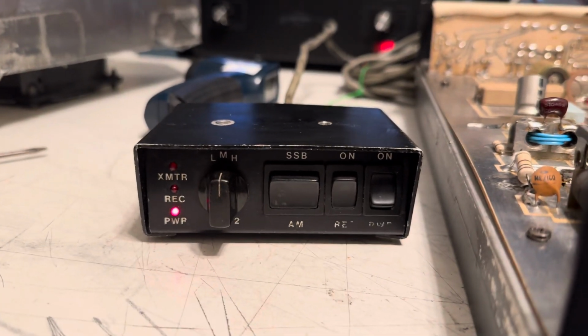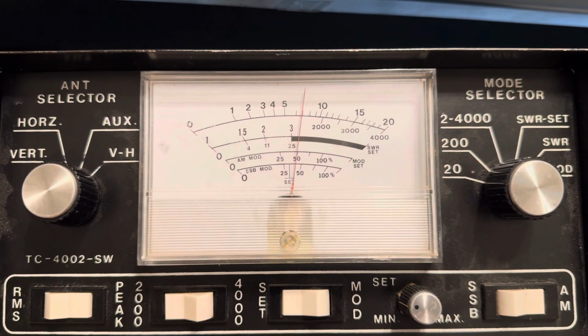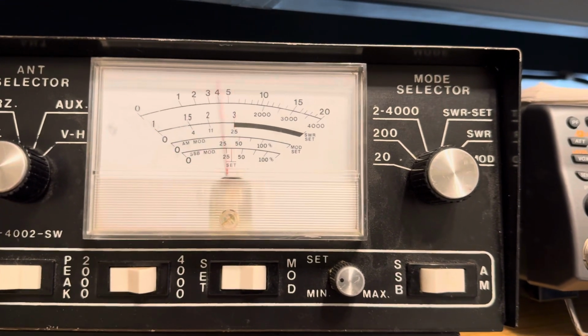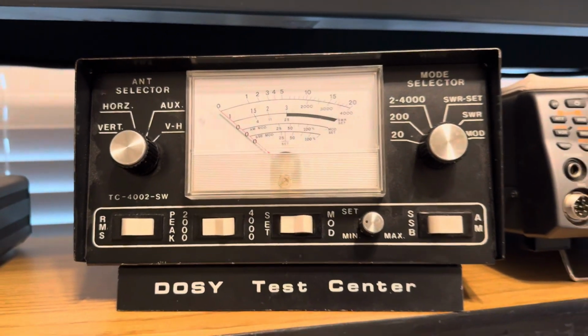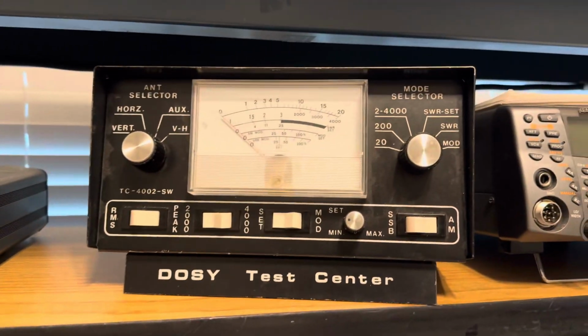So now we're going to go to medium. And then I'm going to go back to putting this back on low. Now it's on medium. About 400, swinging 700. It's about, let's see, a little over 500, swinging 700. It's already too much carrier. So you kind of want to pad that. I like putting the padding on so you don't drive as much. Remember, the radio only has about a 1.5 watt dead key, and it's already dead keying over 500 on medium. That's not good.